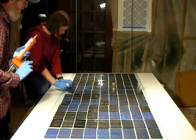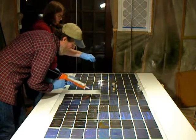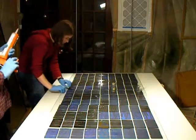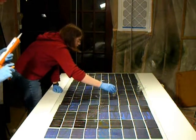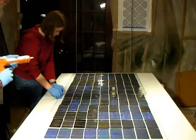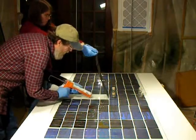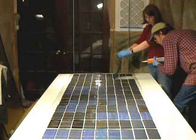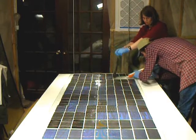Space the solar cells evenly across the glass with 2 to 3 inches of space on the edges to allow for the bus wires. Do not let the solar cells touch — this will short out the entire solar panel. Attach each cell to the glass with clear silicone caulk. Glass weights can be used to prevent sliding of the cells. Small point attachments will allow for expansion and contraction of the unit. Do not completely attach the cells to the glass, as this will make it difficult to replace cells and will not allow the unit to expand and contract.